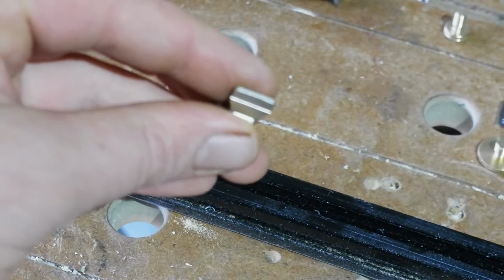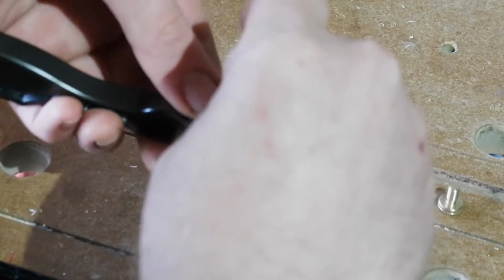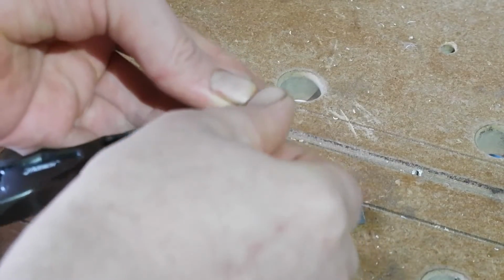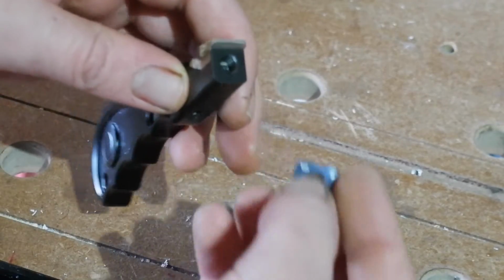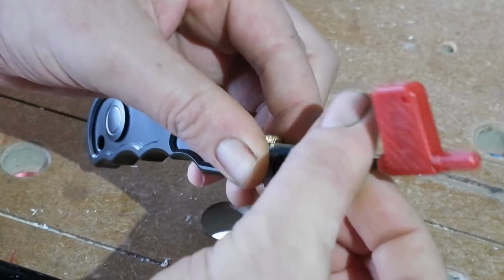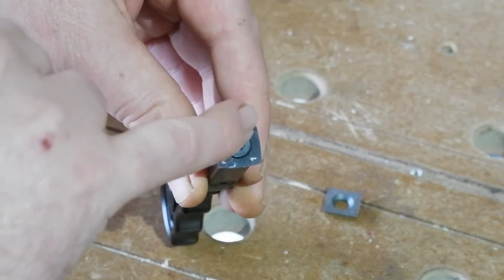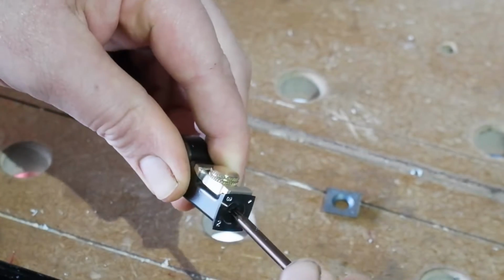Of course, these types of carbide blade are readily available, being popular in turning tools and in a variety of shapes. Some round ones might be useful for this tool. On the multi-sided ones like these, you also have 4 sides to use before needing to replace or sharpen. Put back together, the contoured blade perfectly seated and ready to go. The other blade can be stowed back in the handle.